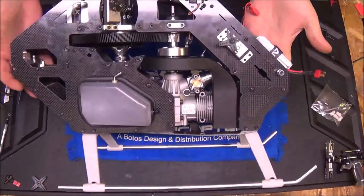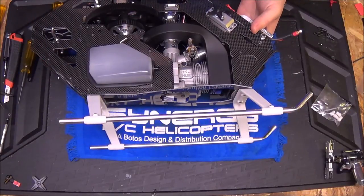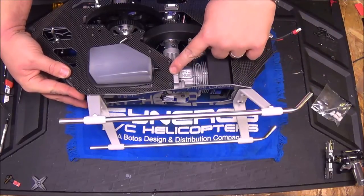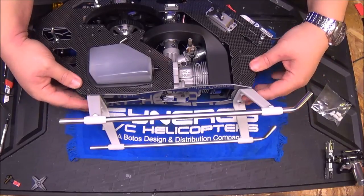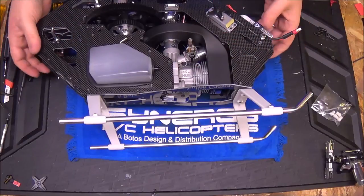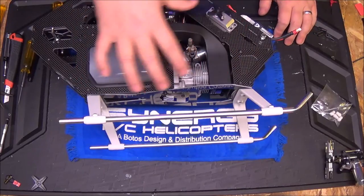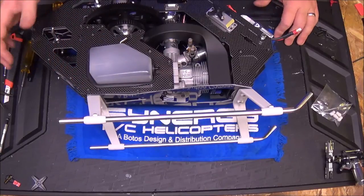Alright guys, there she is sitting on the skids, all pretty. All four skid bolts lined up perfectly. The skids hold the main bottom plate on, which holds the whole frame square and reinforces the motor mounts. Those four screws lining up and tightening without a problem tells me the frame is square and the motor mount isn't putting any undue torquing force on the frames — that shows that the step I took to make sure the frames were double-square paid off.